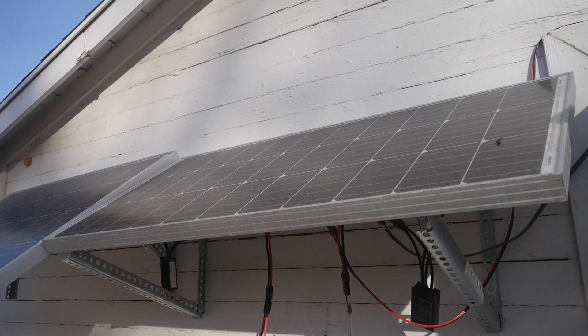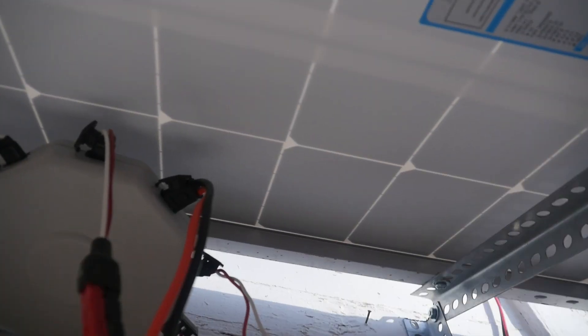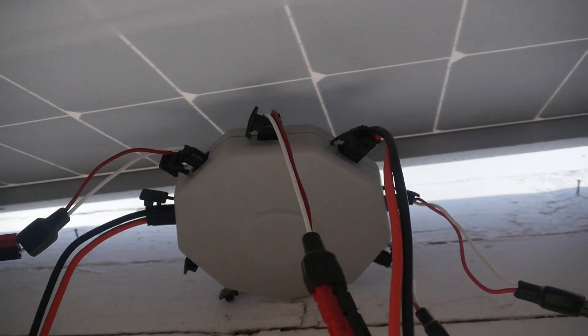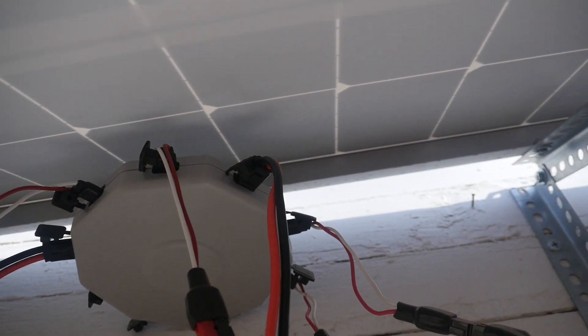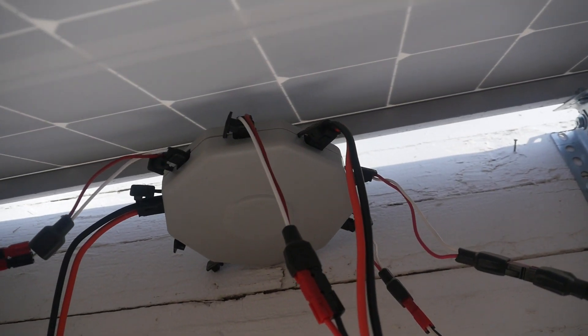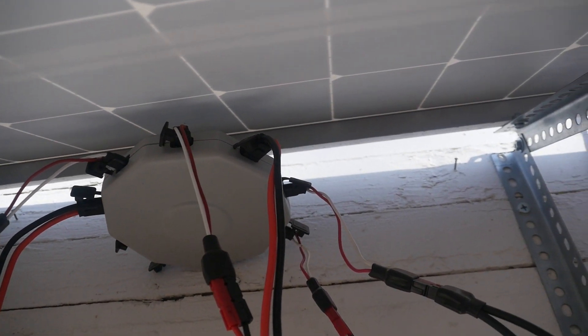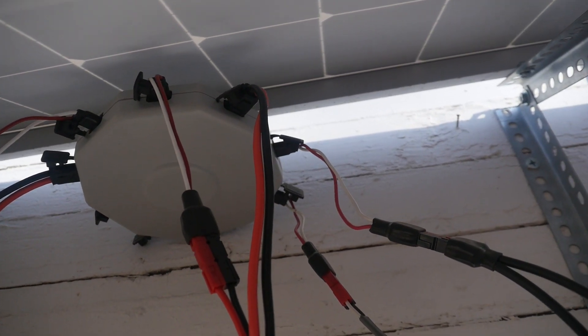I've got my solar panels mounted on the outside of my garage. I put in little watt meters so I could tell if each one is working. I ran them into a Harbor Freight power junction box — five solar panels going in there. It'll handle up to 400 watts rated. These five at max put out 80 watts each, so that would be 400 watts in an ideal situation, but it's not.